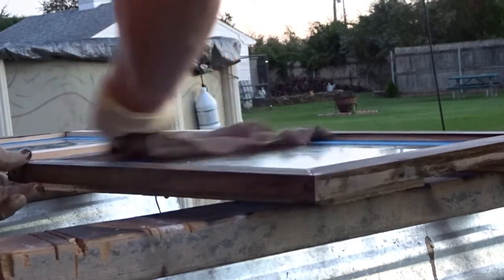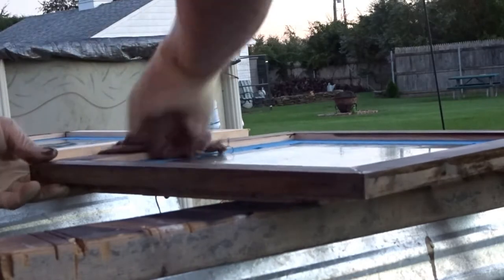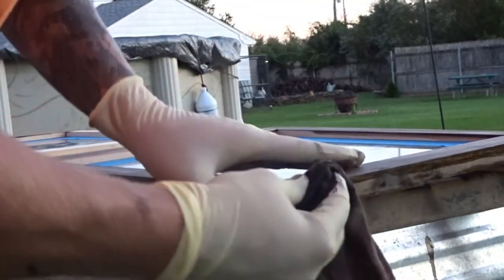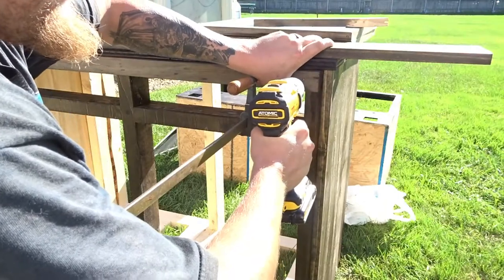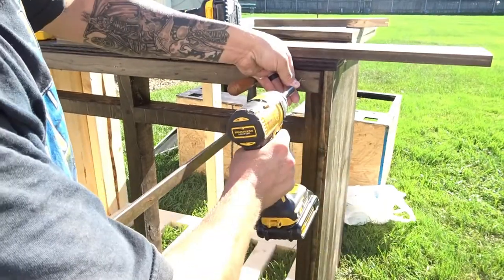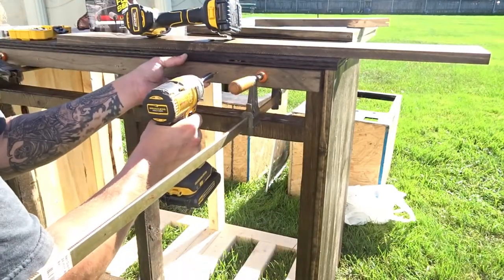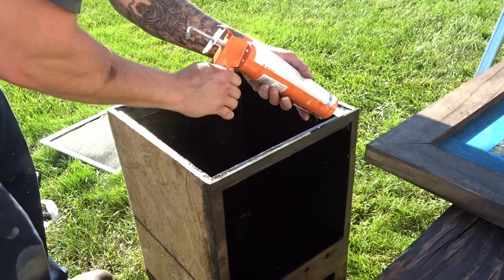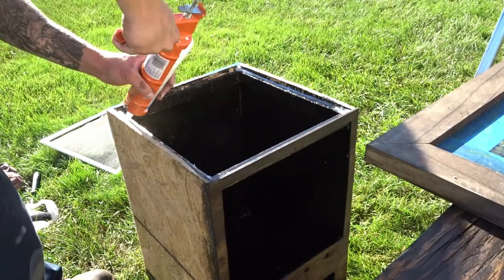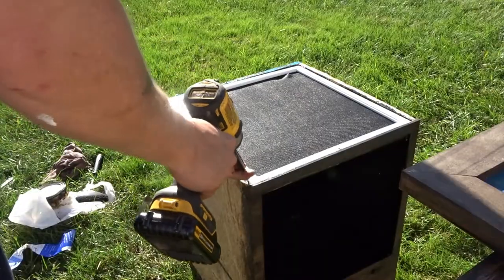I'm going to stain one side of these doors and use liquid rubber on the other side. Be sure to tape off the glass. When everything is dry, I'm running a bead of silicone so it's waterproof and holds better. I cut a piece of one-by-two the same size as the one-by-eight from before — this will be for the door to access the lights up top. I screw the one-by-two piece above so hinges can be added later, using cabinet screws to hold it into place.